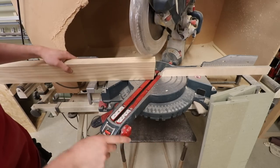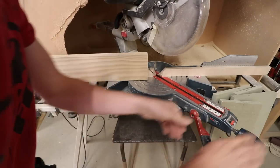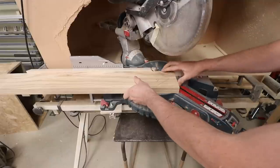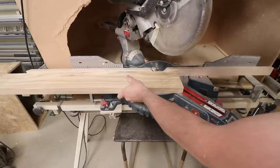So it's 38.7 degrees, just in the opposite hand. Remember, we're leaving these lines just on, so we're going slightly full of the line because the pencil line won't mark dead tight into that corner.